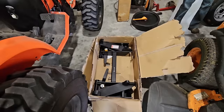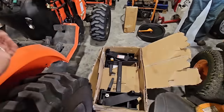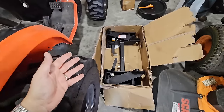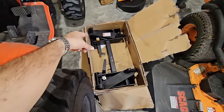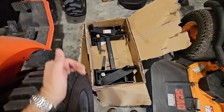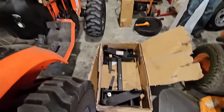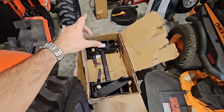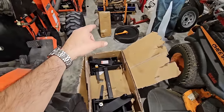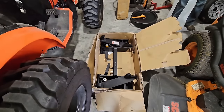So my welding buddy, who you guys have seen on the channel, he's actually the one that welded the hooks over here. He welded the hook that's on the back of the bucket, and he's gonna take this, he's gonna extend it out so the width of the outer edges of these are 44 inches apart, which is what you want them to be to fit the inside of that fork attachment right there. He's gonna weld a solid plate there, he's gonna build a bracket off of it, and he's gonna put the John Deere quick attachment onto that bracket, so I can hook it up to my excavator and have some forks